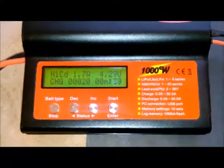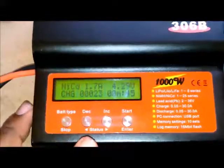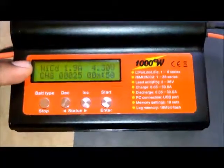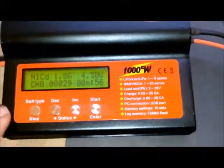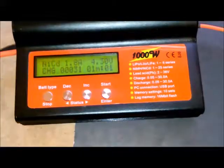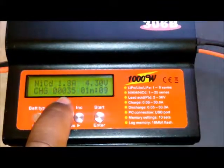This is the third round of shock treatment. Last time I put in about 40 mAh, so I'm going to put in another 40. It's not holding the 2 amps like I want it to — it is decaying and the voltage is going up, so I know there is a possible voltage rise in the pack. It was at 4.28, 4.29, now it's at 4.30.